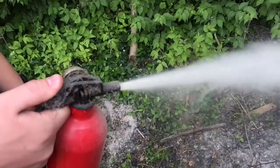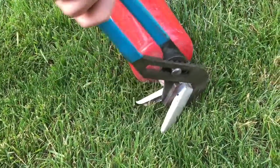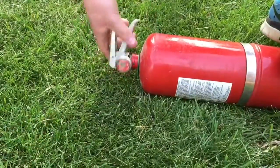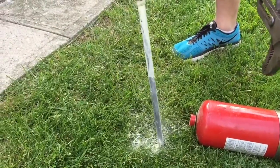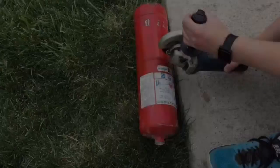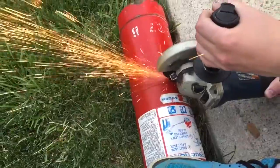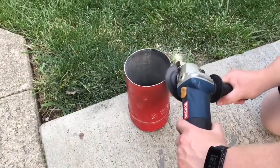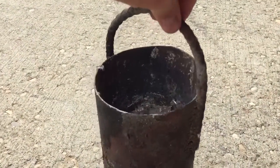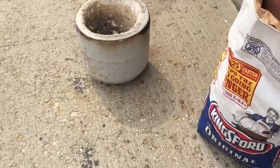Now I'm going to make a crucible, and I'm going to use an old expired fire extinguisher. I just take the lid off once I've exhausted all of the contents inside — just loosen it off. Once I get that off, I can take out the stick and dump out the rest of it. Now I've got my empty container, and I'm going to take my grinder, same as I did with the propane tank, and cut it to the desired length — a little bit shorter than the depth of my furnace. Then I took a rebar piece, bent it over, and welded it on the side — you don't have to do that, but I did it for ease of grabbing it out of the furnace.